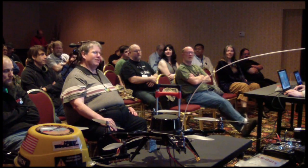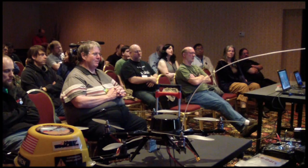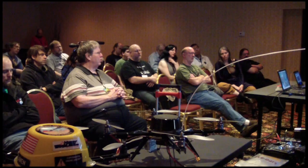Yeah. You get the heads-up display onto the video camera. Basically, with the telemetry system we're using, you patch the camera into telemetry and back out of it, so it's OSD on the craft, beaming that video back. Okay. This is the video stream as it's coming to me. What I did was, on the video receiver on the ground, I put two video outs: one into a recorder, and the other into the goggles I fly with. So yeah, that's exactly what you see as the pilot. This is the quality of video you could expect just by recording on the ground station.